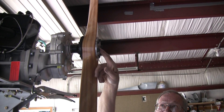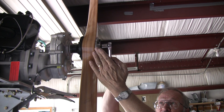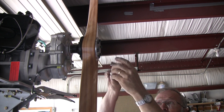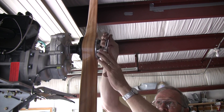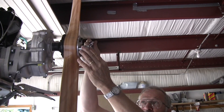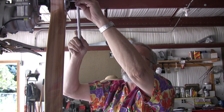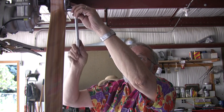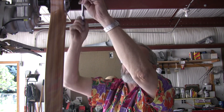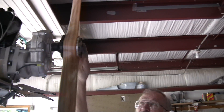You want to make a mark on one of the bolts — that will be your index mark — so that when you get ready to tighten down your bolt, you start at your index mark and go to the one exactly opposite, tightening down an equal amount. For example, if my mark is straight up, I'm going to turn a quarter of a turn, and I'll do the exact same thing for each bolt. I'll go a quarter of a turn in a star pattern, then come back the same direction, a quarter of a turn each time, doing the outside edges the same manner.